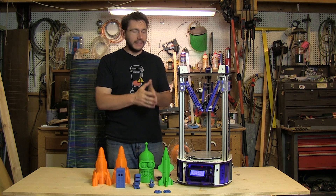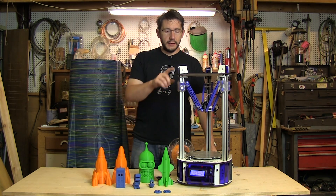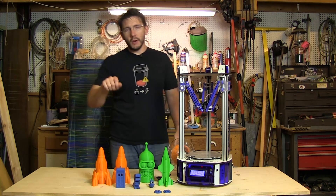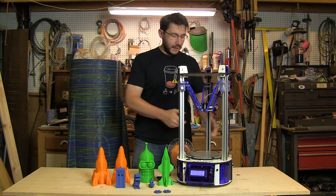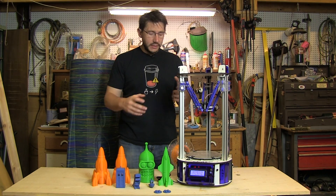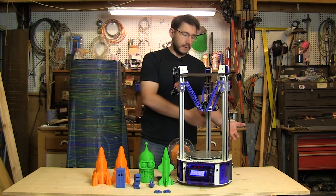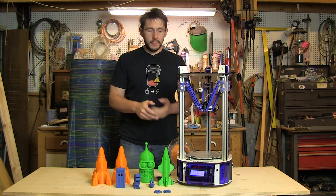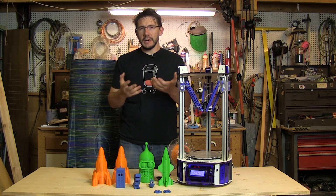This brings me to the first thing I don't really like. The spool is mounted in the back, and the filament is supposed to route through two holes in the cutout boards to reach the drive motor on the side, making a hard 90-degree turn. I don't think that's optimal — when I route it through the guides as designed, the filament binds and makes noise. My workaround is to just let the filament route loosely around the back of the machine instead. It's an easy fix, but I wish they'd done it differently.